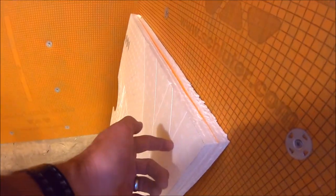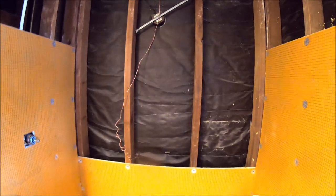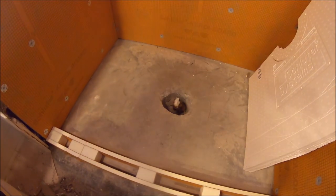We are making good progress here. We have board up here, board up there, board up on the right side. We're going to install our prefab shower pan, curb down here, waterproof this so it can set up, and then frame out the niche on this back wall. Flange kit here — let's install this pan.